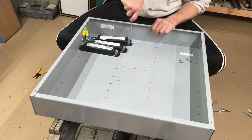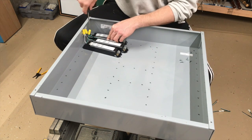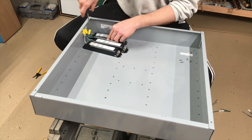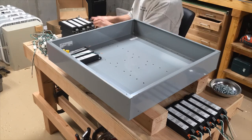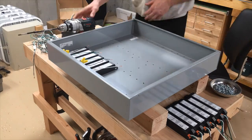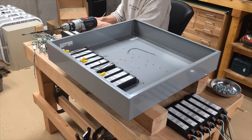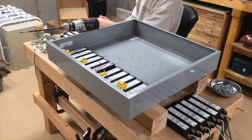I wire the drivers together in groups of three and screw them into the housing. Unfortunately, you're watching me kind of screw this up, because these drivers are not supposed to be mounted within an inch of each other — they give off heat that needs to dissipate. And clearly I've got them a lot closer than an inch.